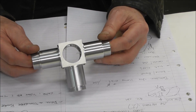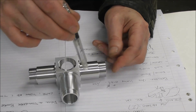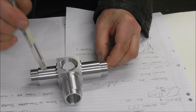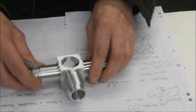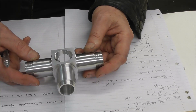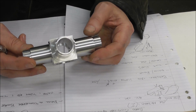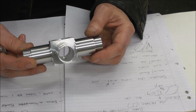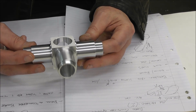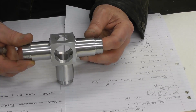Let's look at this part. Could you lay it flat on the table and use a ball nose cutter to 3D profile CNC machine it? Well, it wouldn't be accurate enough — the tolerance requirements are too high, and even on a high-speed Japanese machine you just wouldn't get enough precision. It wouldn't work for the threads and the shoulders. It's really a lathe job; it's got to be turned to get the concentricity and parallelness. So what are the different options for lathe machining? For a one-off part like this, more time is spent on work holding, planning, and measuring than actual machining. A manual lathe is more versatile — I've got faceplates, four-jaw chucks, and a tailstock — so it's looking like a manual lathe job.